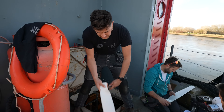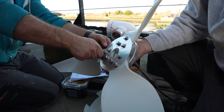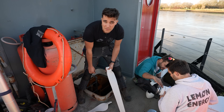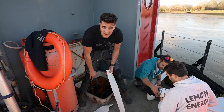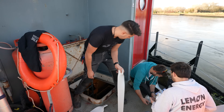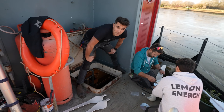So these are the blades here — you can see they're quite big, and this is only a 400 watt turbine. It's one of the downsides of wind: how much surface area you actually need just to make that spin to generate the power. I have been looking into making my own wind turbine — I was tearing down bits of a washing machine. All you need is a DC motor; you could use a drone motor. Whatever voltage you want to output, you just need to make sure that motor is going to take that input. I've gone as far as making the charge controller, got all the components and a breadboard to solder it onto, but I've just not found the time yet.